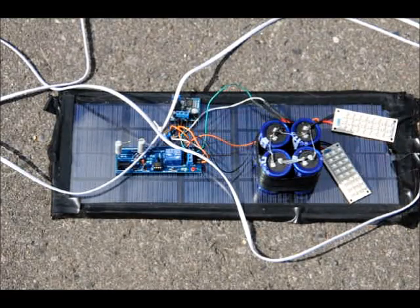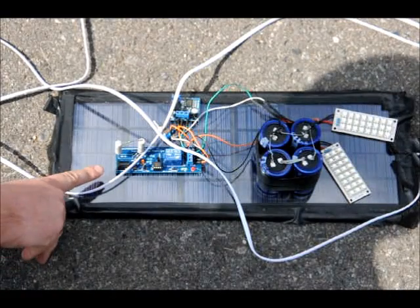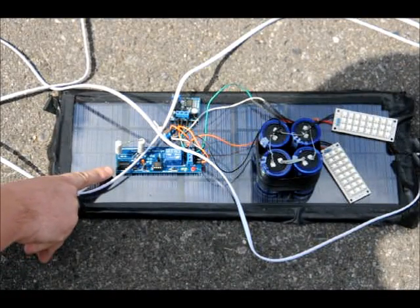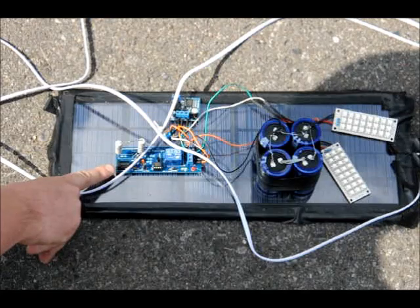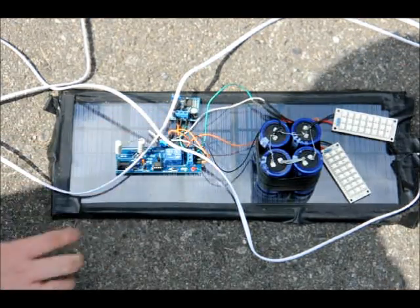What we have is two 12-volt LED banks, four 2.7-volt 400-farad supercapacitors, two sets in series — so total capacitance is 400 farads at 5.4 volts. Down here we have my supercapacitor flashlight kit, modified slightly, with a 12-volt booster and a switch.